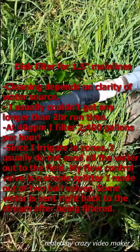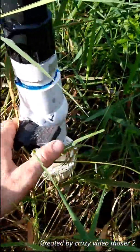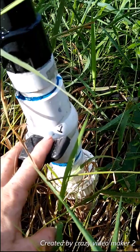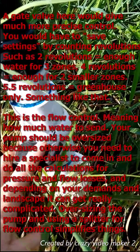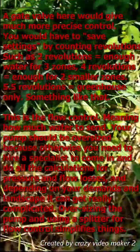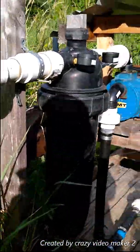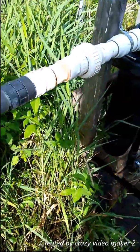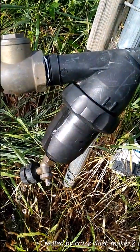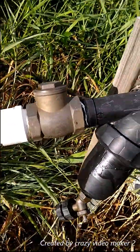After the disk filter we come to a split here, where I made it number one spot. This will feed a good amount of water flow to feed two fields, or just the greenhouse by itself. The remainder of the water gets split up and it goes back to the stream — it's really only been cleaned at that point. Once it goes past that, it goes through a very fine filter here, which is leaking right now — this is a very fine 200 mesh filter for use for drip irrigation.